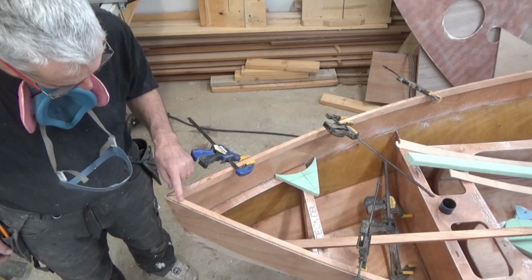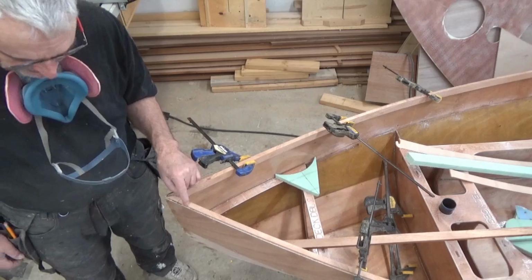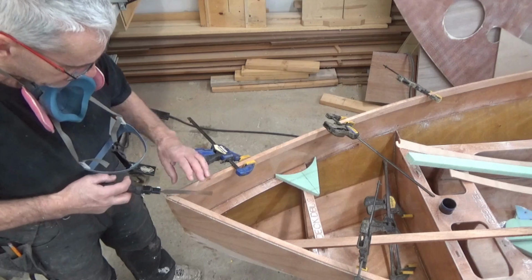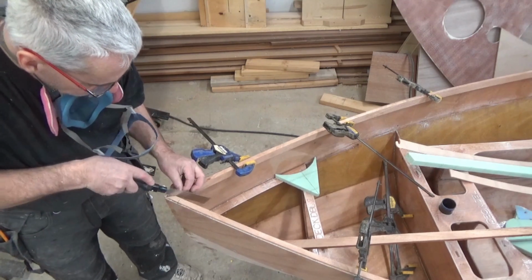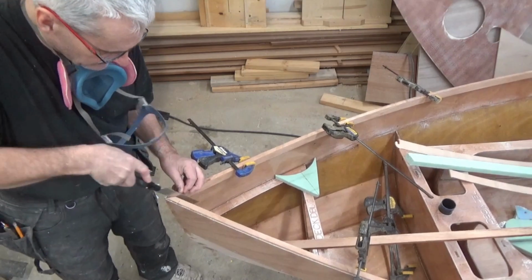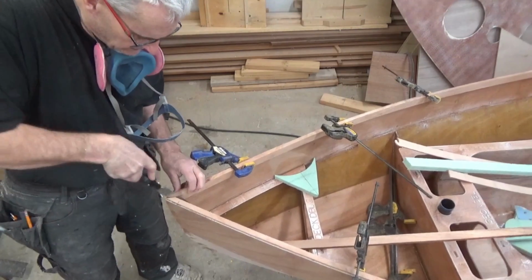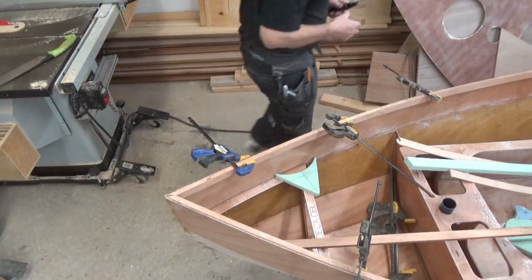there is still some off of the starboard side here that needs to be beveled. I can't really take too much more from this side or we come up short on the stern end because this one is a perfect fit right now. So with these two pinched, what I'm going to use is a flush cutting saw, so it only has kerf on one side. Theoretically I shouldn't be removing anything from here. Then we're going to tap the gunnel forward a little bit and do it again.